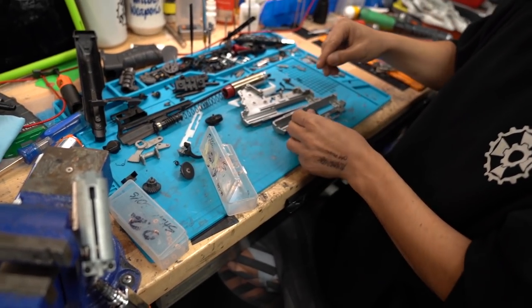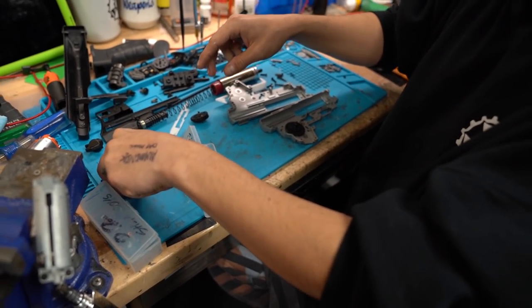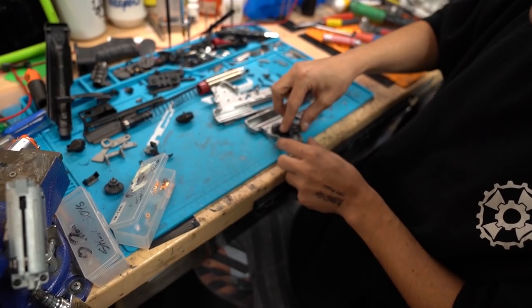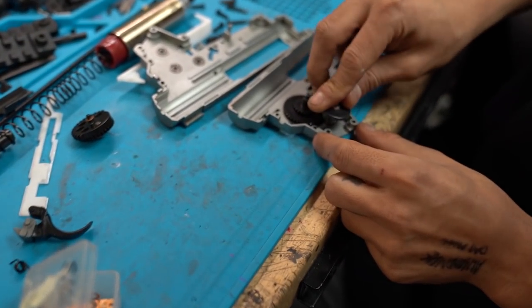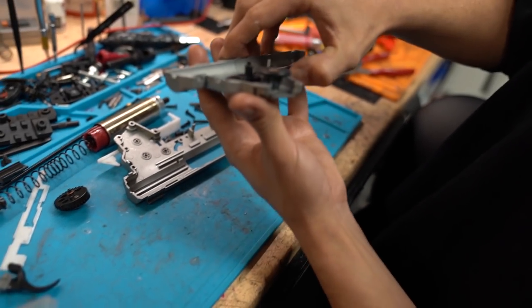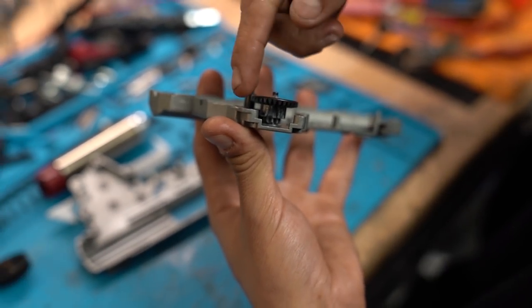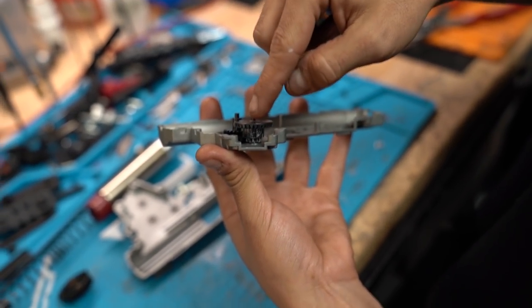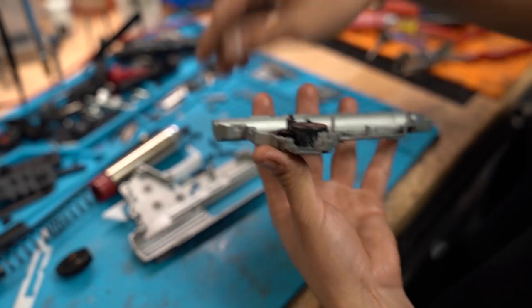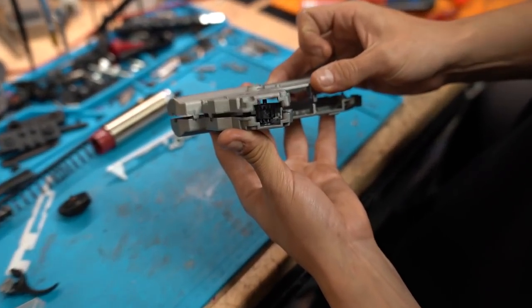So essentially you do this to each gear. You do it to this gear, then this gear, then this gear. Then you put all these gears in here and double check that you have enough clearance in between these. If you look at the right angle, you can see the edge of this gear and the top edge of this gear, and they appear to be just a tiny bit too close. Gotcha. Even if you have the top of the gearbox on, you'll see, because the surfaces will start to rub. Exactly.